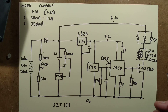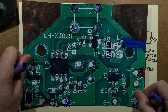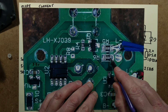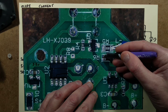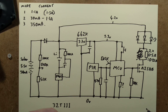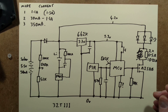One of the best improvements you could make to this would just be to actually remove one of these resistors off the board completely and just leave a single 0.5 ohm. That would cut the current down quite dramatically and extend the lifespan. You've got that option if you do have one of these modules. If you want extra battery life and it's being triggered quite a few times, just put your soldering iron across this resistor and slide it off the circuit board, and that will pretty much almost halve the current.